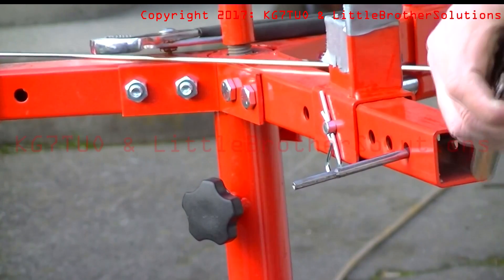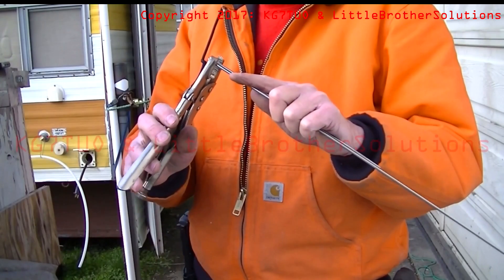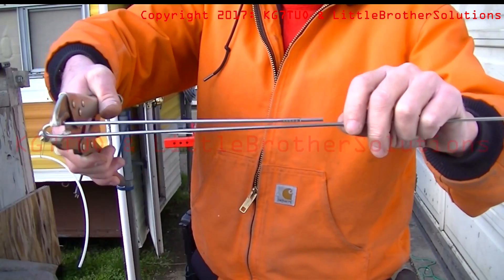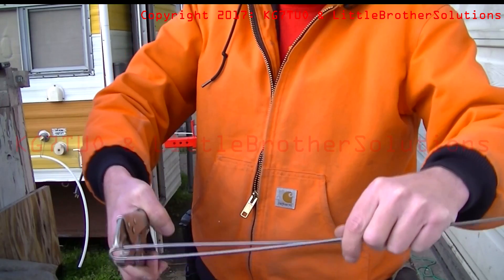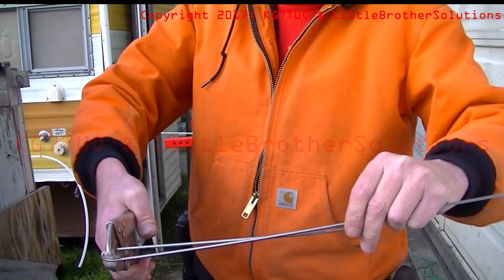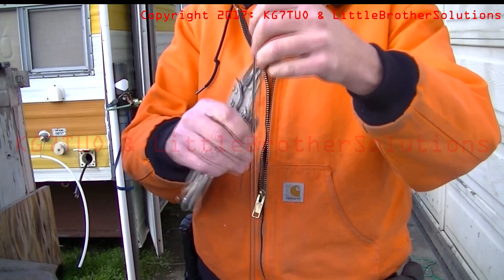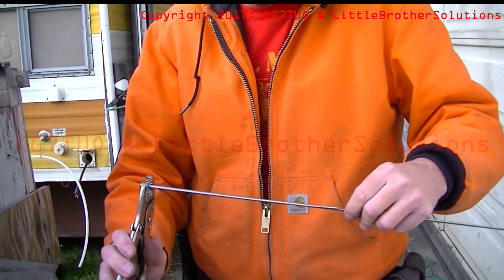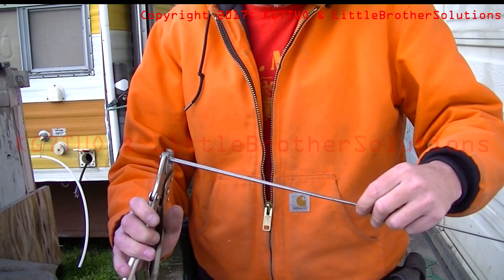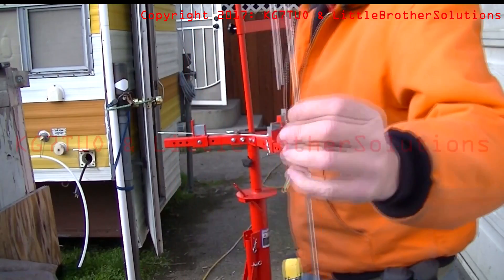There's most of it, but as you can see it's not straight. Try to get these elements parallel. You don't have to go past parallel because it springs back on you — that's a little too far, but we can spring it back. Just fiddle it a little bit. Pretty close. We'll do some fine tuning after we've cut it, because we'll be jostling it around when we cut it. Let me make the other one real quick.